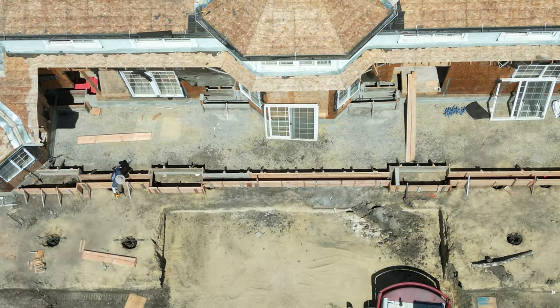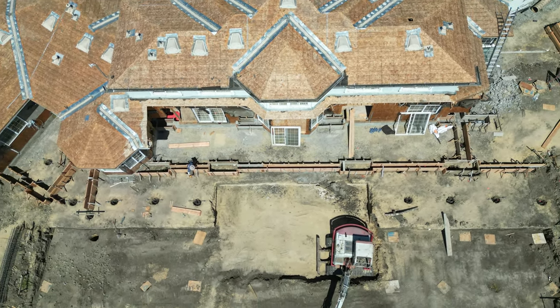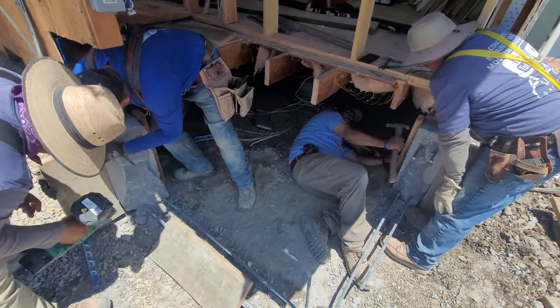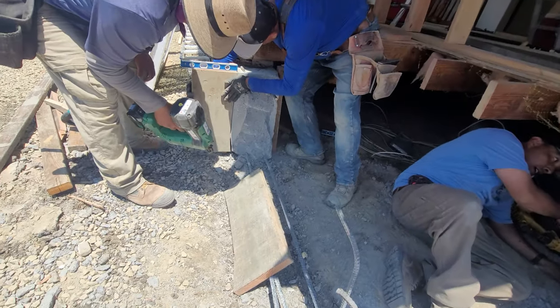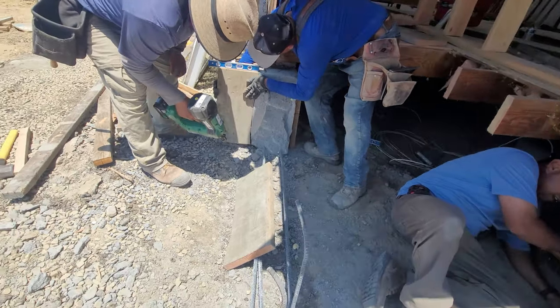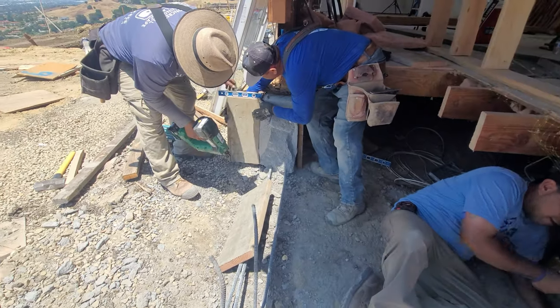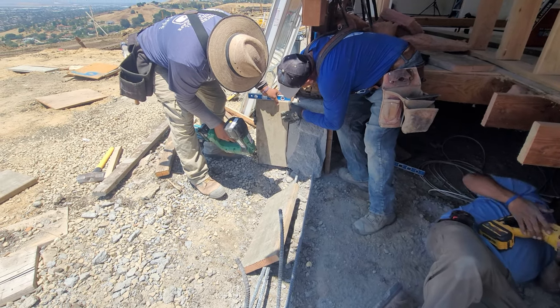The primary thing that we're doing here, we're going to be installing a 4,000 square foot deck. We got about 120 piers, averaging about 14 feet deep. We got about 10 tons of rebar that we're going to be using up here. We're also going to put in probably about 10,000-12,000 square feet of concrete for 2 fire truck turnarounds. So this is a big project.